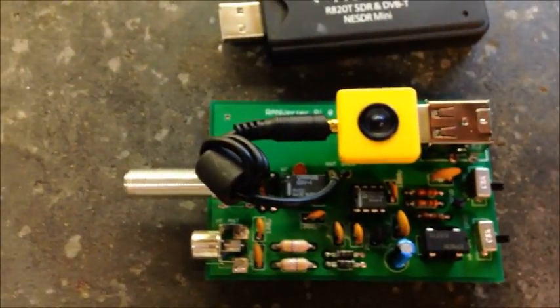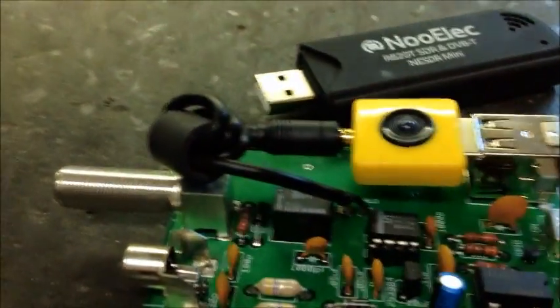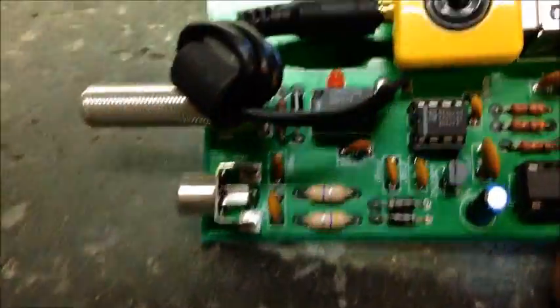For a novice it would probably take a good hour. I did do a couple of things not in the instructions. I put a little heat shrink tubing around the shield at the coax connector, because you have to cut that off the little antenna he supplies with it. Then I ferrite beaded the antenna line just for RF protection — I run amps, so just in case RF wants to come in through the antenna side. Everything else is pretty much put in place the way the board's laid out.